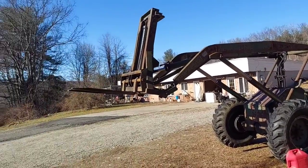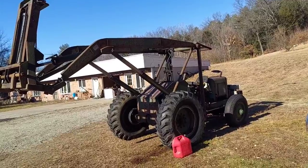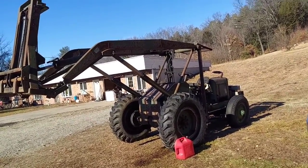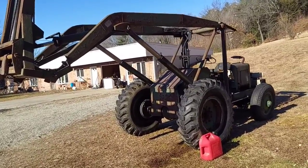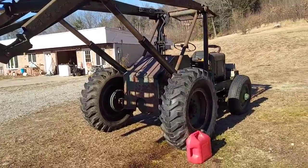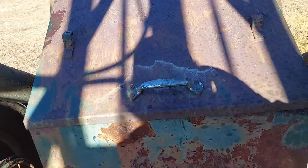It's a late 40s, early 50s machine. I added five gallons of hydraulic fluid today, put it all the way up in the air and ran the forklift all the way up — it's got to be 30 feet. Neat old machine, still runs good with a Red Seal Continental 162 in it. Brakes work. The biggest problem is the shifter is worn out on the transmission — if you push down on it, it shifts fine, but if you pull up on it, it pops out of gear.